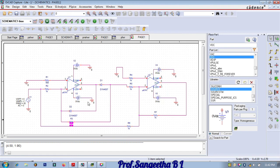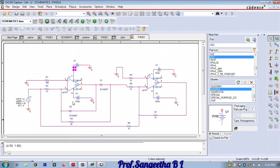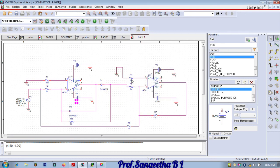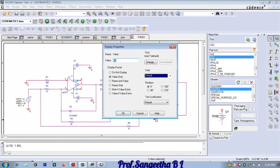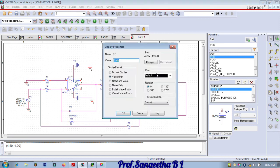The supply voltage is 12V and the other is minus 12V — but don't enter it as minus 12 since polarity is already set, just enter 12. The diode resistor value is 470 ohms. The remaining resistors are 1k, 1k, and 3.9k ohms. For the op-amp supplies, set one to plus 12 and the other to minus 12. This completes the values.